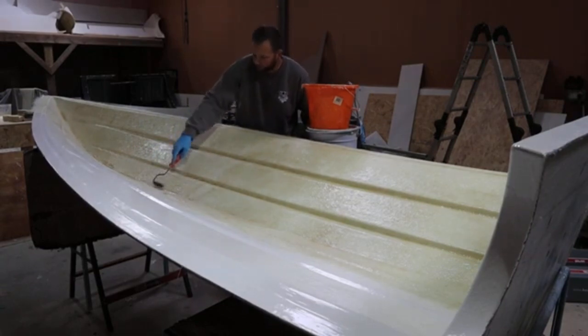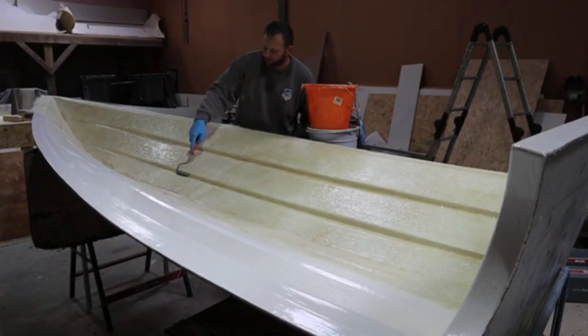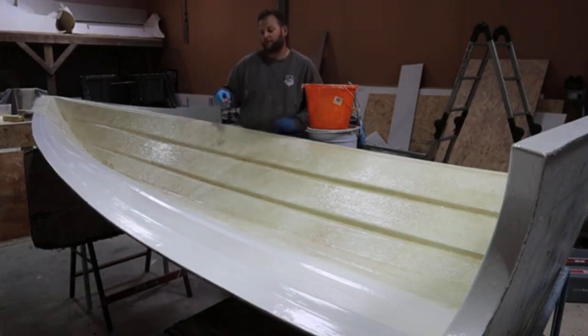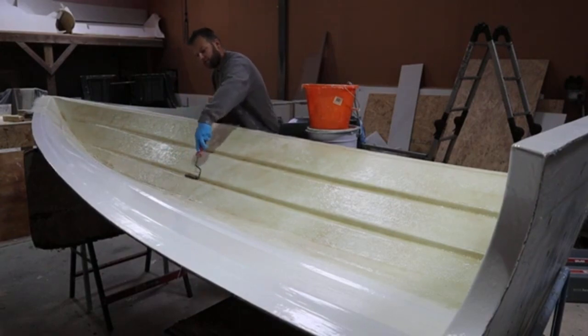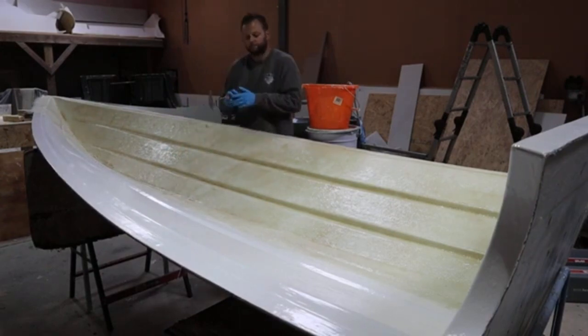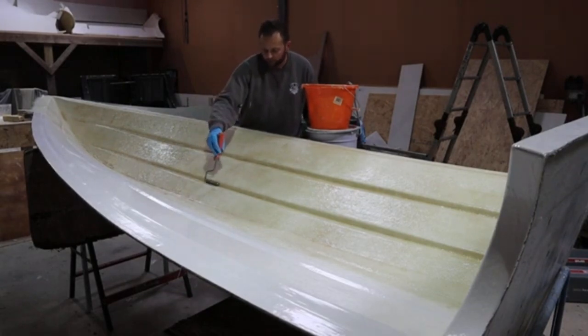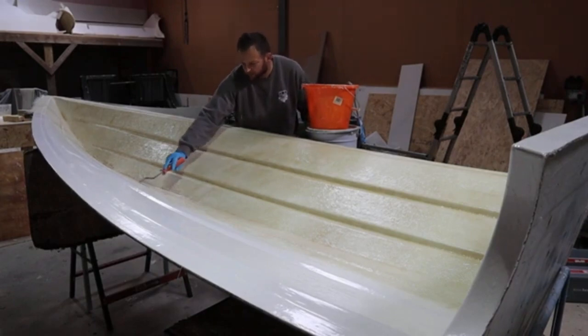Okay. So you can see this join, it's a nice thick join in the keelway. It's going to be nice and strong. So this will double up because obviously the other one on the other side is going to come up to here. So we're going to end up with a really nice, big, fat, strong spine running through this boat. And it may only be small, but even Jerry's with their first one at Ocean Ribs, they put the 40 on there and they're almost doing 40 knots with it. But it's got to be safe.